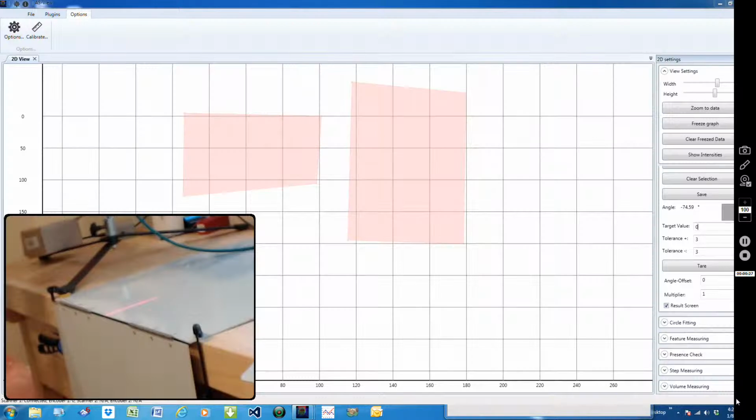And here you may have a hard time seeing that laser line. So if we block the camera, you can see how the gain increases, so you can see where that line is. That laser line at the near end is approximately 4.7 inches, and on the far end it's about 6.3 inches long. And in the AP820 we're using a CCD camera, so we're not going to have any trouble with any colors or reflectivities. It's a very robust laser sensor to be able to measure different colors.